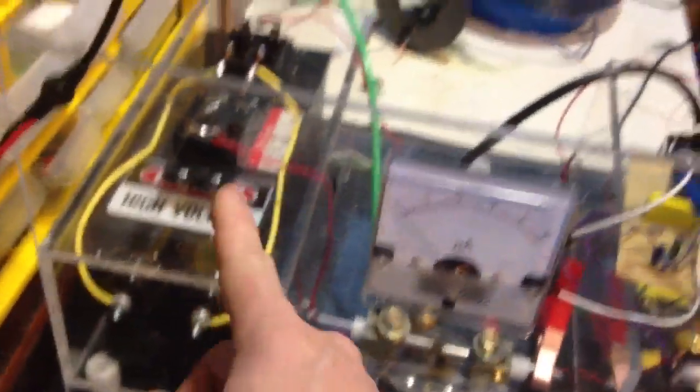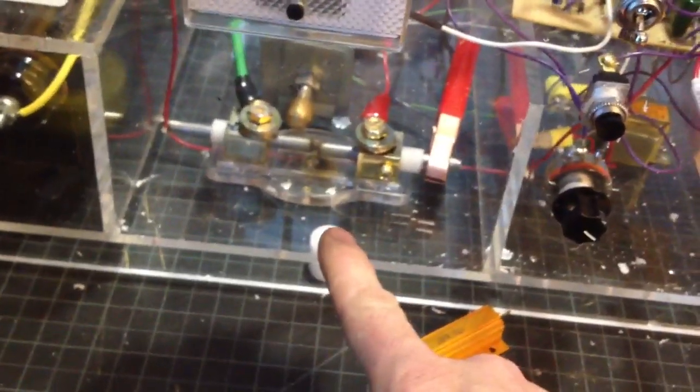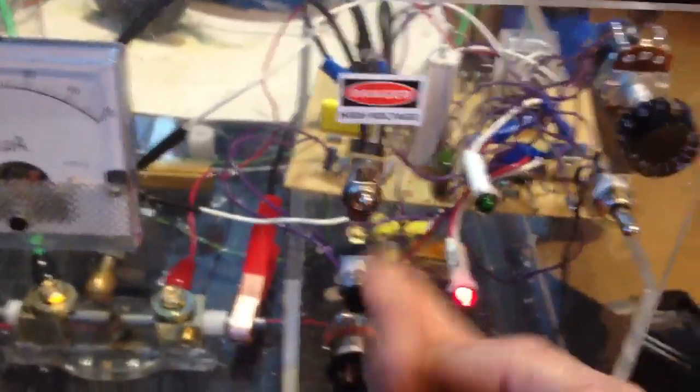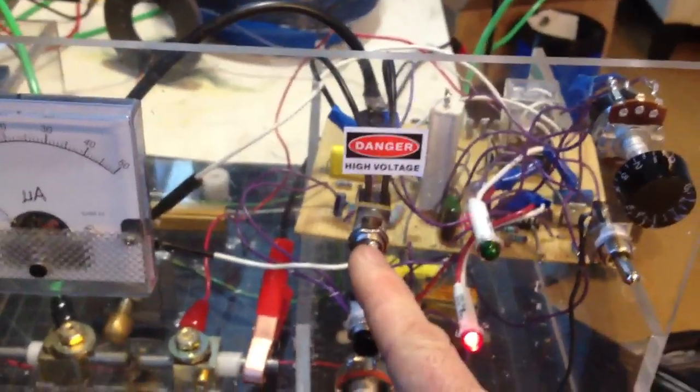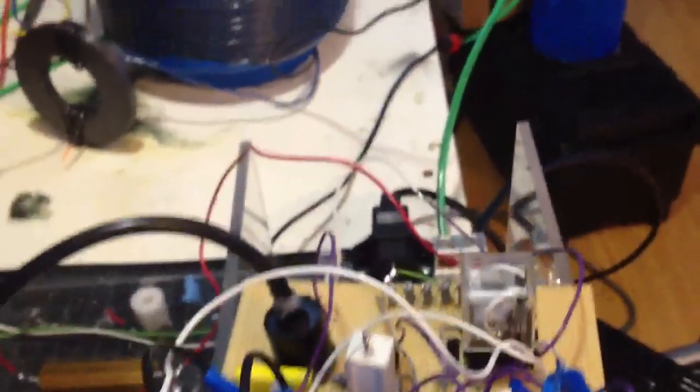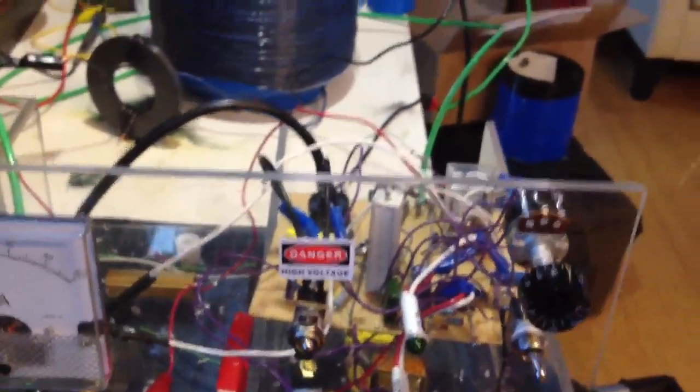Right here is a voltage charging unit — a transformer with a bridge rectifier to get it to DC current, and then a spark gap switch, so the electrodes never actually touch; it's connected via a spark. This is the charging unit — the green light indicates it's on. Flip this switch to engage the charging unit, and you can set your level right here. If you want 5,000 volts or whatever, you can see this relay switches in the back when you reach the level you set.